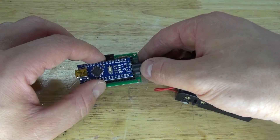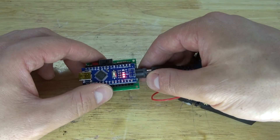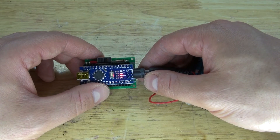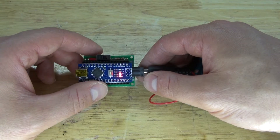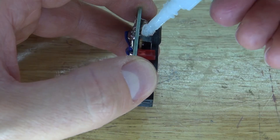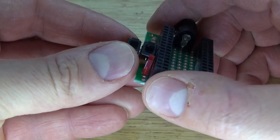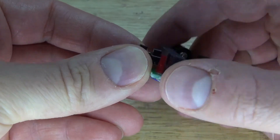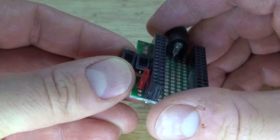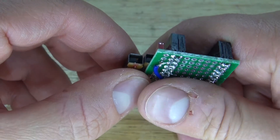Place the Arduino Nano into the circuit. As you can see, the Arduino Nano stays on even though the LED is off — so a modification is needed. The next modification is to take another slide switch and carefully glue it next to the first one. Apply super glue carefully so you don't accidentally glue the switch mechanism in place, then glue the two switches together, making sure they are nice, even, and level so both switches turn on and off together.